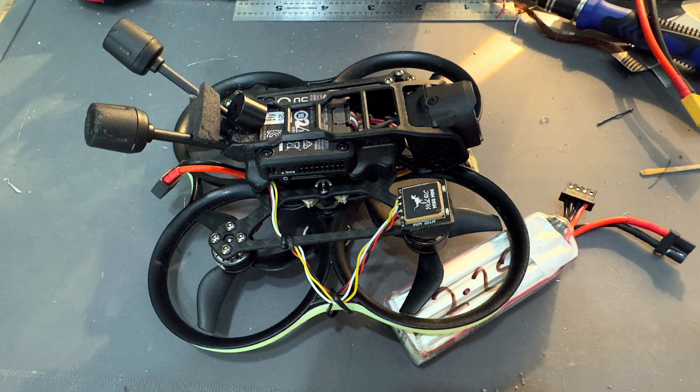There's one more thing to try. I found a couple videos with folks that powered the GPS before the rest of the quad with some rather complicated wiring tricks. This reduced the electronic interference from the other components and let the GPS work better. I didn't like their wiring ideas much, so I plugged the quad into Betaflight before flying, let it gather satellite data for a couple minutes just from inside the window, then unplugged it, powered it up, and it got eight satellites in a minute.